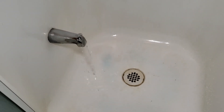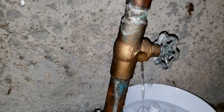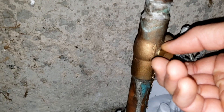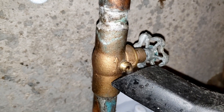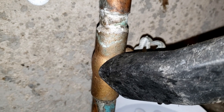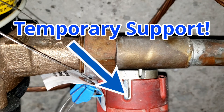Once gravity draining has ceased or slowed, remove the existing valve's cover and capture any residual water escaping from the drain port. Then proceed to vacuum out as much water from the drain port until there's no more water coming out. Prior to uninstalling the existing valve, ensure that the downstream water meter, which is relatively heavy, is sufficiently supported to ensure that no stress is placed onto any adjoining pipes or fittings in case the meter was shoddily installed, as is too often the case.